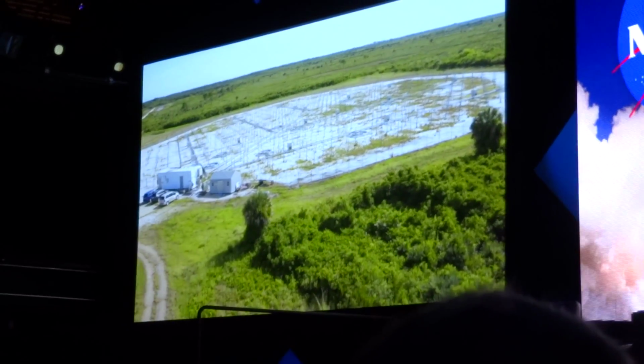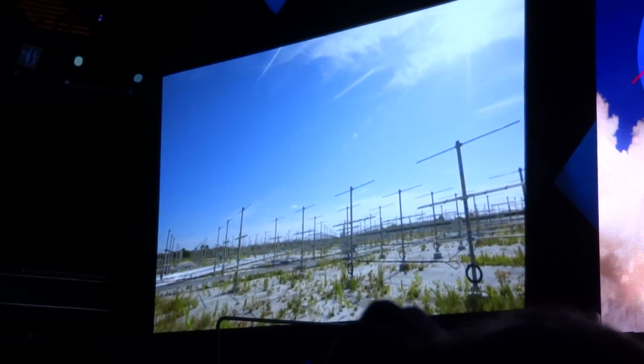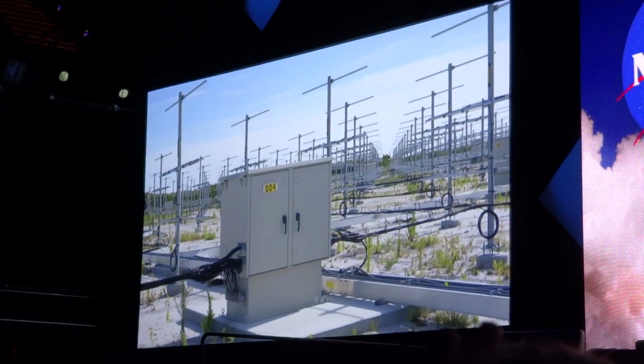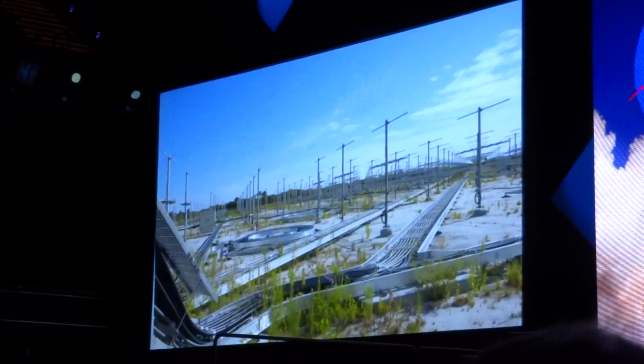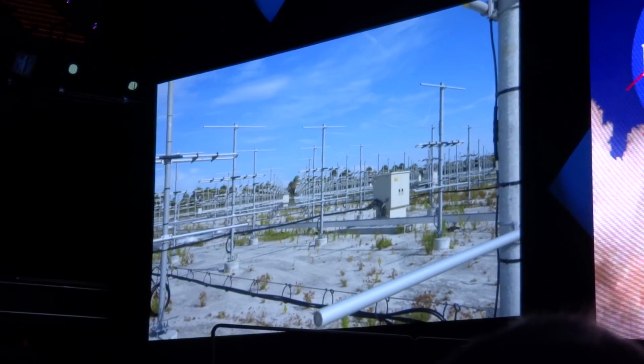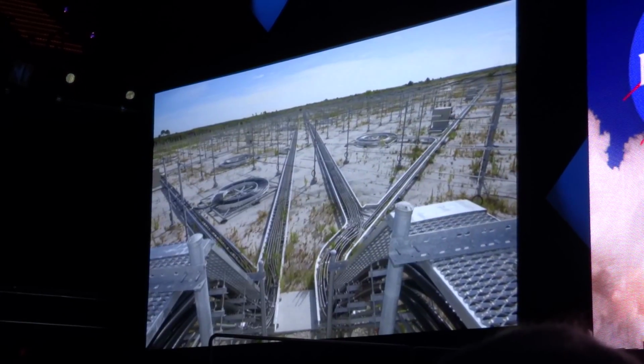So this unit that exists today, they've got this large, high-power microwave antenna array running at 50 megahertz. It pumps thousands of watts of effective radiated power up into the atmosphere, and it measures the reflections off the microparticles in the atmosphere to tell what the wind speed is at different elevations. Now the problem is today, this instrument is vacuum tube technology, and it's not certified as a primary instrument.